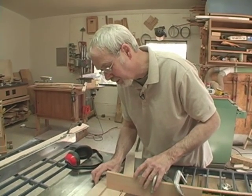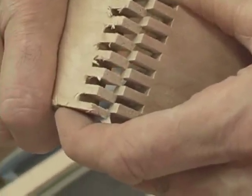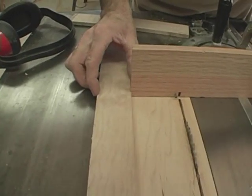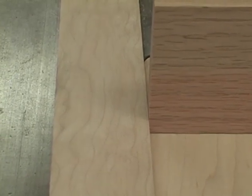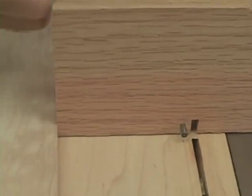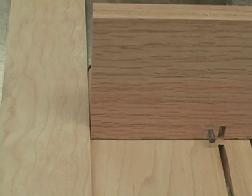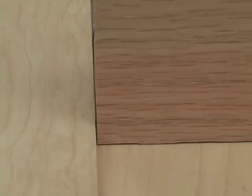At this point, if I put a frame of reference there, you can see how much needs to come off. So now if I put my stock down in place at the end of the jig — I've got it very tight — I'm going to loosen my clamps and move it the other way to narrow the space between my guide pin and the blade. I've opened that space just a little bit, and I'll lock my clamps down again to hold it tight.